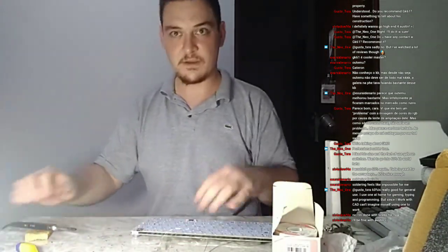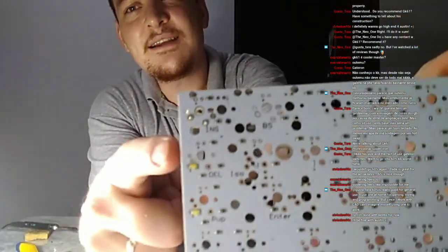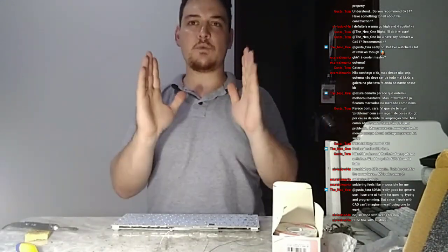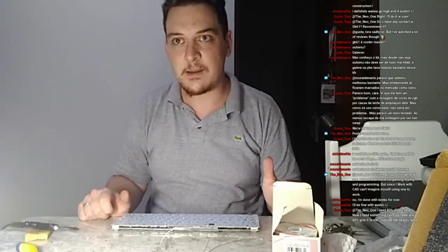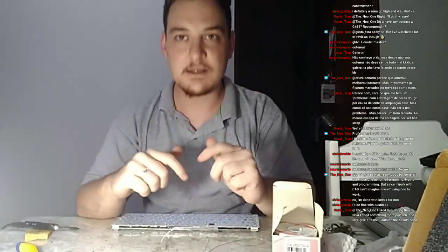Okay, so let me show you guys. So this is what you're looking for. There you go. So shiny spots, shiny connections. I don't know if you guys can see, but the camera won't focus. But the soldering spots should have this tent curve to them, like this, right? You don't want them a blob, like a round blob, and you also don't want too little solder. Why? If you take too little solder, the electrical joint that you are doing is not reliable. Also, if you do a big blob, it's not reliable either, because you can't see if they were joined correctly. So you want that tent shape, because that tent shape tells you that the two metals did adhere correctly, and the electrical joint there is nice.